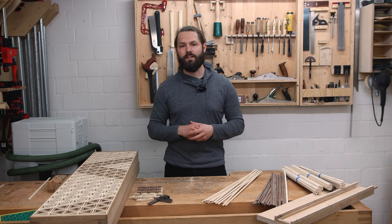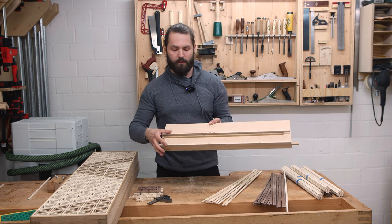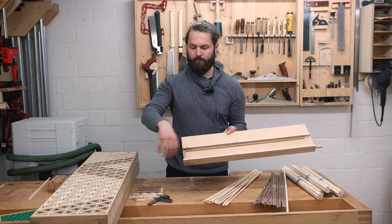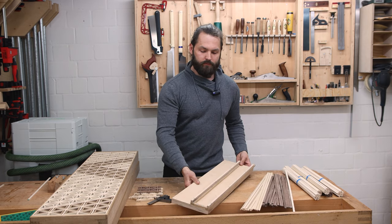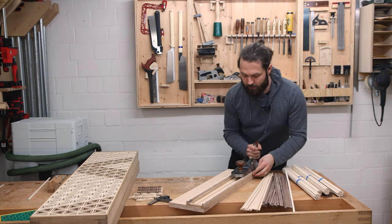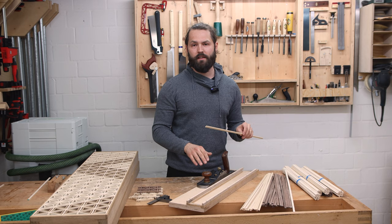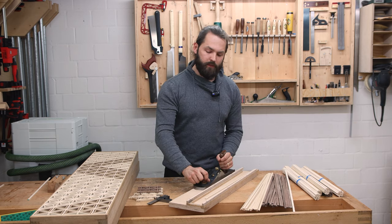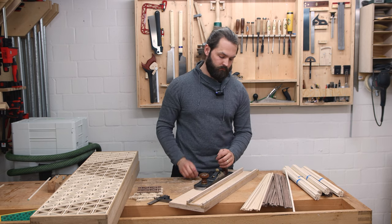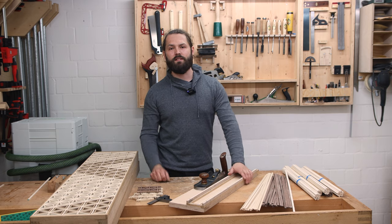That was the version with the drum sander. If you don't have one, no problem — you can make yourself a pretty simple jig. It's just a piece of plywood, two strips screwed to it, another two strips on top of those, and one strip that prevents the Kumiko strips from sliding off. You put your rough sawn strip into it and with a hand plane you can clean up the strip. To get the right fit you can adjust the blade in your plane, or shim the strips up with a piece of tape or some paper underneath. It's a bit slower than the drum sander method, but it still gets you there.